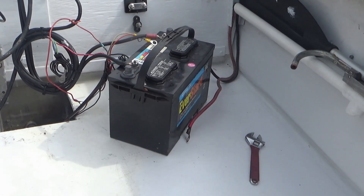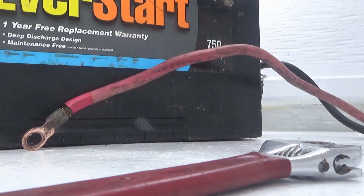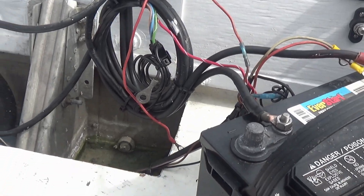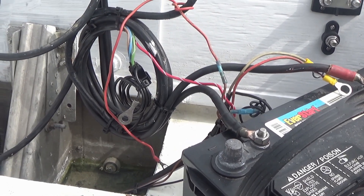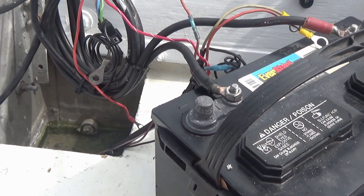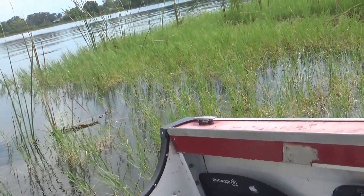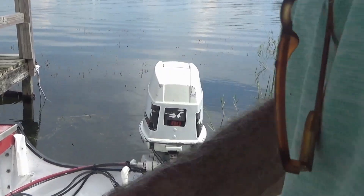It's going to take two batteries to run that far. Let me get the meter just to see where that battery's at right now — 12.33, even lower than before because I just yanked more voltage out of it. I need to take it out here and run the piss out of it to get the voltage up. This battery should be put on the charger for a real deep cycle charge. I don't know if it'll work with the cables after that. I don't have a problem putting two batteries in here — that'll take care of my other problem. I hate lugging batteries around when I want to use the trolling motor. If they're already in here I just crank up the motor, get where I want to go, switch it to 24-volt, bing bang boom.